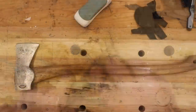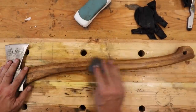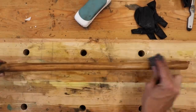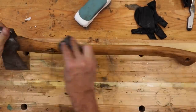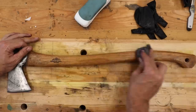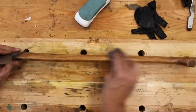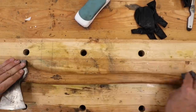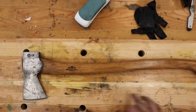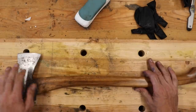Don't forget the poll. Once you get the head all done, take that steel wool and polish the handle real quick before we put on our boiled linseed oil — mainly just to clean the dirt off and any chunks we didn't get with the scraper. Steel wool is an amazing product for so many things. Look at that — that is really nice. This is only a two-year-old axe, but it's starting to get a really nice patina on it. That's starting to look like something special.